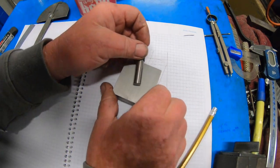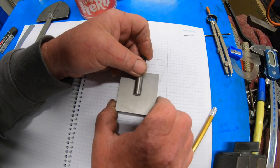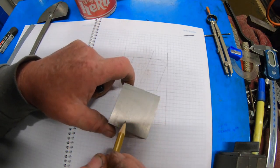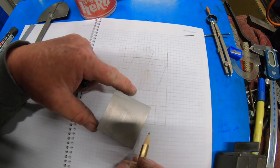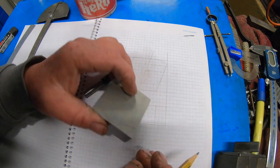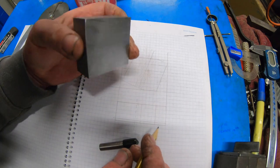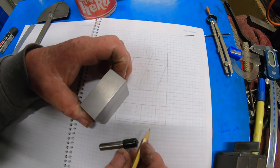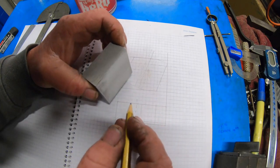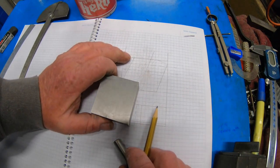While it's sitting like that, I can do this square in the mill and then tip it over and cut the top off, cut the bottom off, then make up a little threaded dovetail bit to go on the end of the adjuster. And then at the end, it's roughly going to be on a 10 degree angle, so I just have to work out the procedure to cut it away here and put the angle on it. That's what I'm trying to see. Anyway, could be a fun little project.